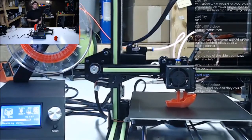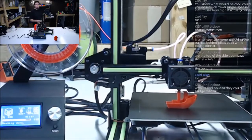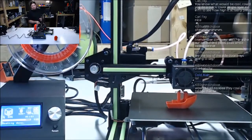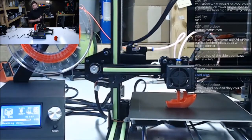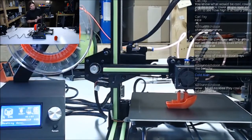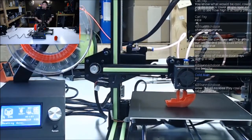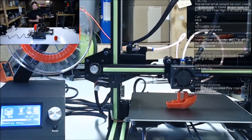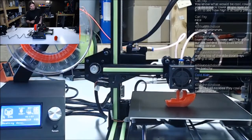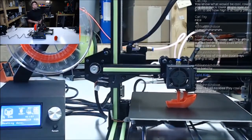I didn't even check. I wonder what the standard nozzle size is on this. I was just anticipating it being a 4, because almost everything is a 4. But that file is created with a 4, so I'm sure it's a 4, though. Well, on a larger printer, they might give you a bigger nozzle, anticipating that you're going to print large and fast. But I bet it's still a 4. I'd have to look it up. That's 4, meaning 0.4 millimeters, 400 microns.